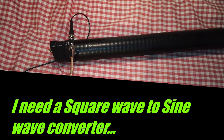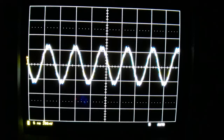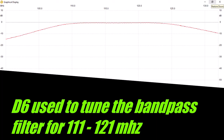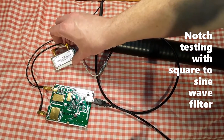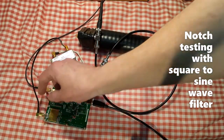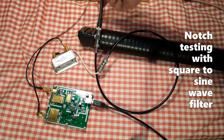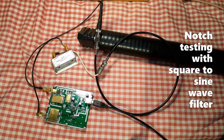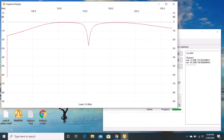I considered that a retuned 100 MHz bandpass filter might be useful in converting the square waves into sine waves. So I hooked it up to the D6, tuned the filter to 116 MHz plus or minus 5 MHz, and put the bandpass filter in series with the Heliax notch filter. I needed a couple of adapters to make the required connections between the D6, the bandpass filter, and the stub. The bandpass filter should reshape the square waves. Then I used a nice piece of round coax in a loop to trap any residual square waves that might try and sneak through — though those of you who've been in electronics a while will know that a square wave cannot go through a loop of round coax. Just kidding.